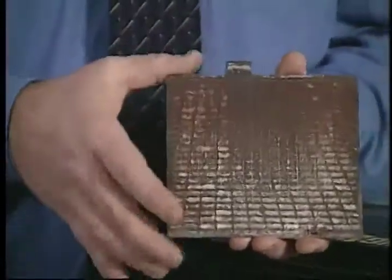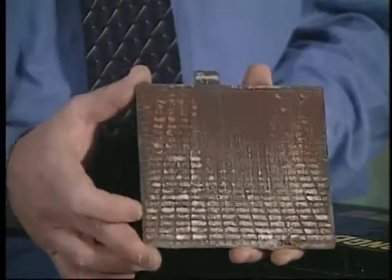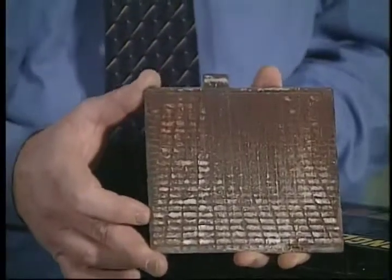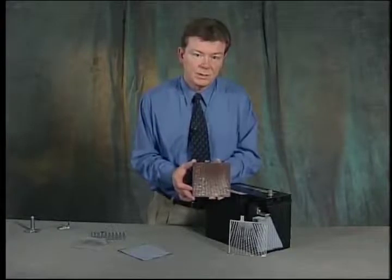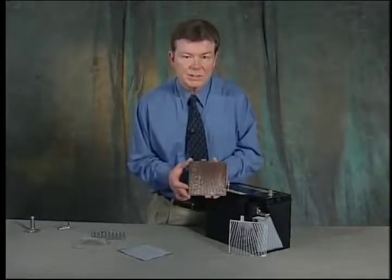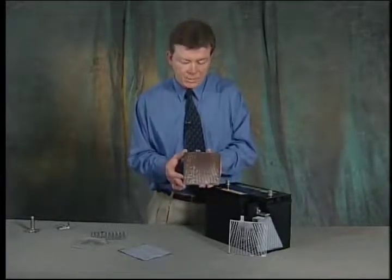The paste that we use in the John Deere strongbox batteries is a high-density paste, which means it's designed for rugged durability, vibration, and cycle life, giving us the highest cold cranking power and reserve capacity that we can possibly get. The paste is important because that is where the electrical energy is stored, and the grid is used to remove that energy from the battery.